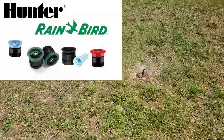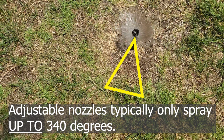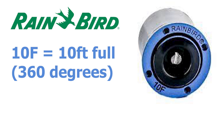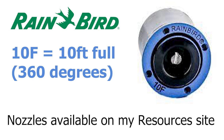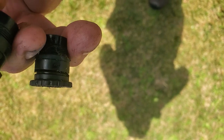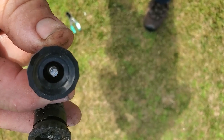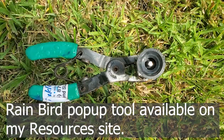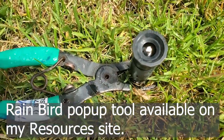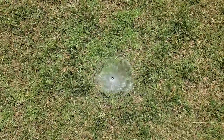Adjustable nozzles are not designed to do 360 — see how there's a gap there? That's why you want to use 360 nozzles. The difference between a 360 on the right and an adjustable on the left is that the spray port is on the side of the adjustable nozzle and it cannot open 360 degrees. This one is designed to do 360 — even all the way around.